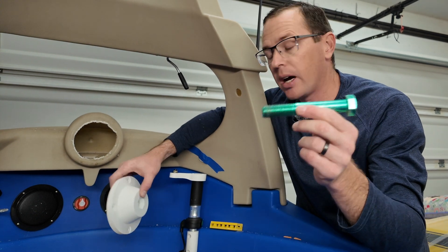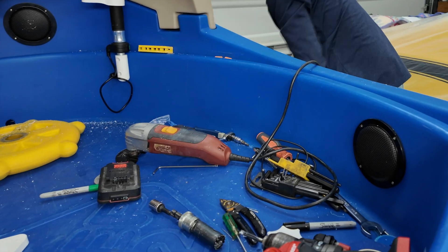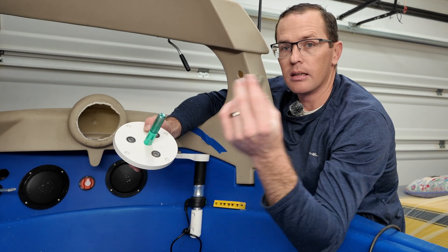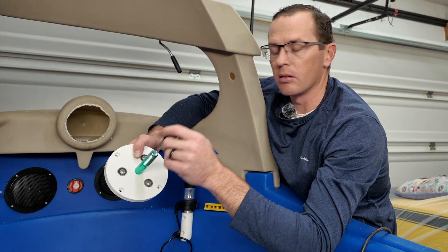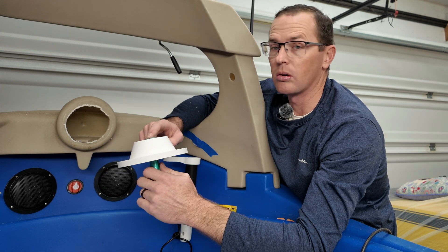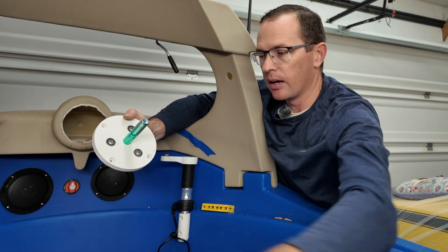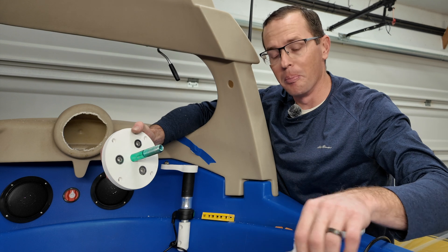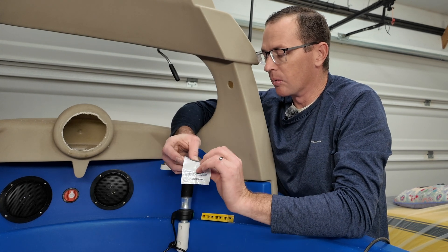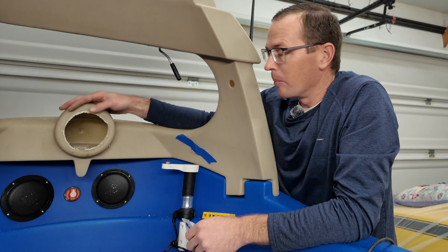The plan is to put our big bolts back in here — this is a three-quarter by five inch bolt and it fits right into the back of the part. Now for a materials list: we've got our three-quarter bolt with a nylock nut. I broke that nylock in by running it up and down with my impact and applying a little heat — if it's strictly as it comes, there's a lot of torque to tighten it down. We've also got some socket cap screws from Atwood's — quarter-twenty one-inch socket head screws at about a dollar a bolt, which hurt my soul. But they had exactly what I needed, so I went with it.